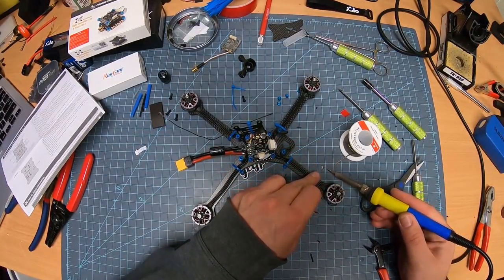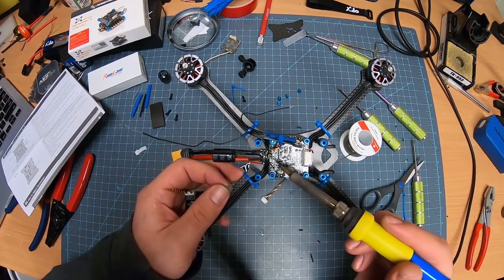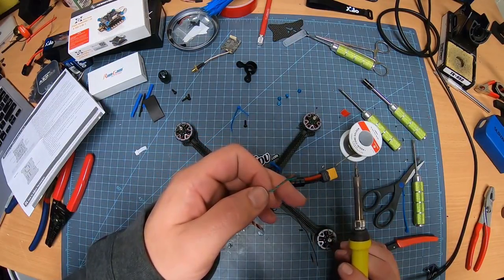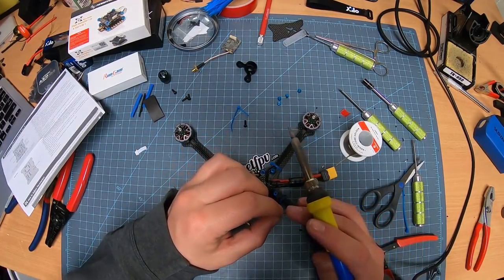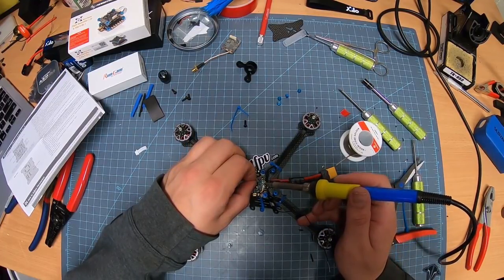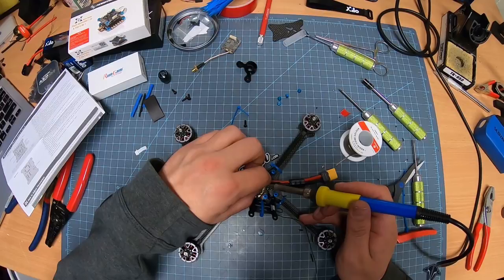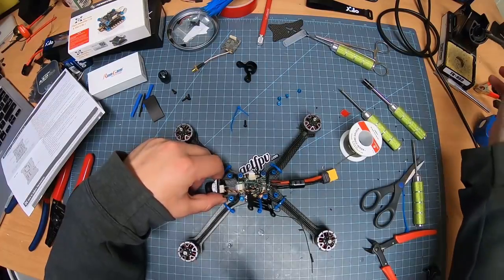And that, my friends, is why you don't solder over the board. On the board, we gotta notice RX and TX. RX is the top, TX is the bottom. So RX is green. Bend it up so the other one's out of the way. So RX. And then TX. Now that's soldered up to it.